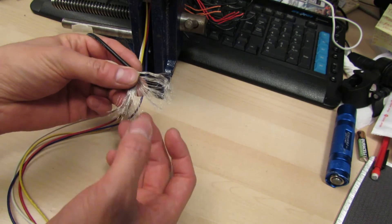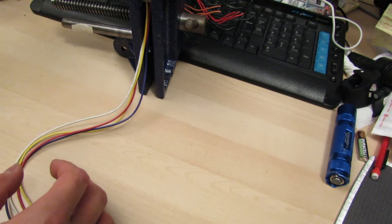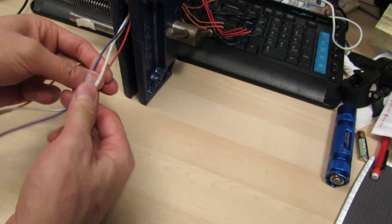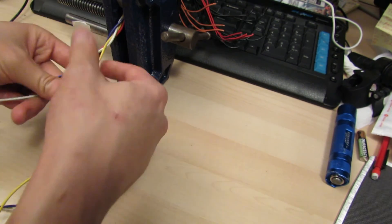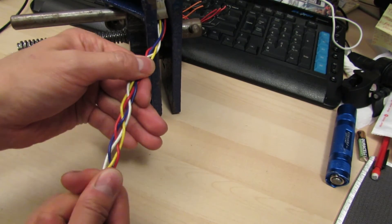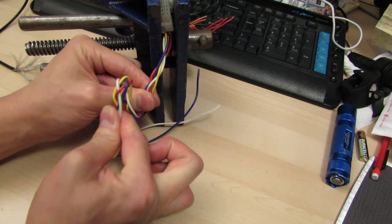Here's how to make braid yourself. If you have thin stranded silicone cable, get four strips of it. Then braid it — always go with the left one: take the white one and go over, under, over. Then take the yellow one and go over, under, over. Repeat that over and over and you'll get yourself a copper braided cable. When it compresses, it's flexible. When you solder it on, make sure you do a snake shape and offset the solder joint so that when you push your battery down, it doesn't go on top of the solder joints.